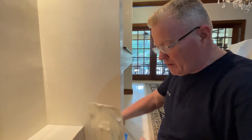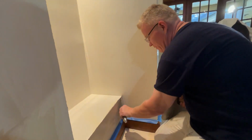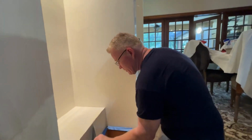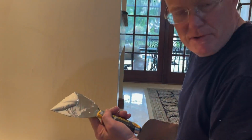It was spider cracking on me, don't know why. And we fixed it with putting fiberglass mesh tape on the surface. But that wasn't it, was it? We made it stable by using sheetrock nails, and that's what they were. They were 1 1/4 inch sheetrock nails to make this substrate stable.